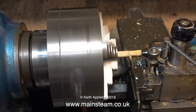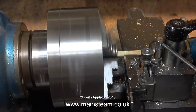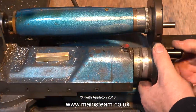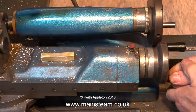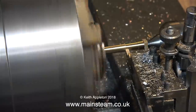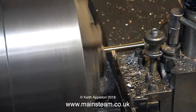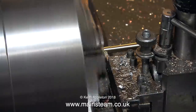I know it's bad practice, but I'm using a parting tool to do this, because it's quite a heavy-duty parting tool and it's the right kind of shape to get a good finish. So the tailstock is locked in position, and the saddle is also locked in position. All movements of the lathe tool are now controlled by my winding of the handle. I've speeded up the process — it took quite a long time to do this and it made my arm ache — but eventually, as you can see, the desired effect was achieved.